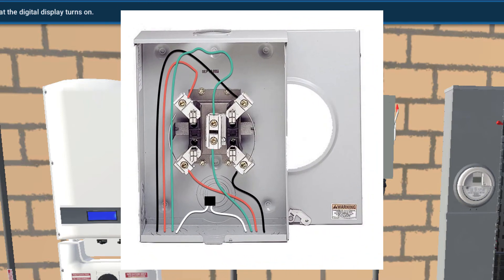This shows the wiring you're going to be doing. The wires from the inverter are going to come in on the left side and go up and attach to the top connections. The electricity flows through the meter and comes out the bottom, and those wires are going to come out the bottom and go off to the right and connect to the AC disconnect. The ground wire is going to come in, connect, and go on out to ground the enclosure. The neutral white wire is just going to pass on through — it's not going to be connected to anything.